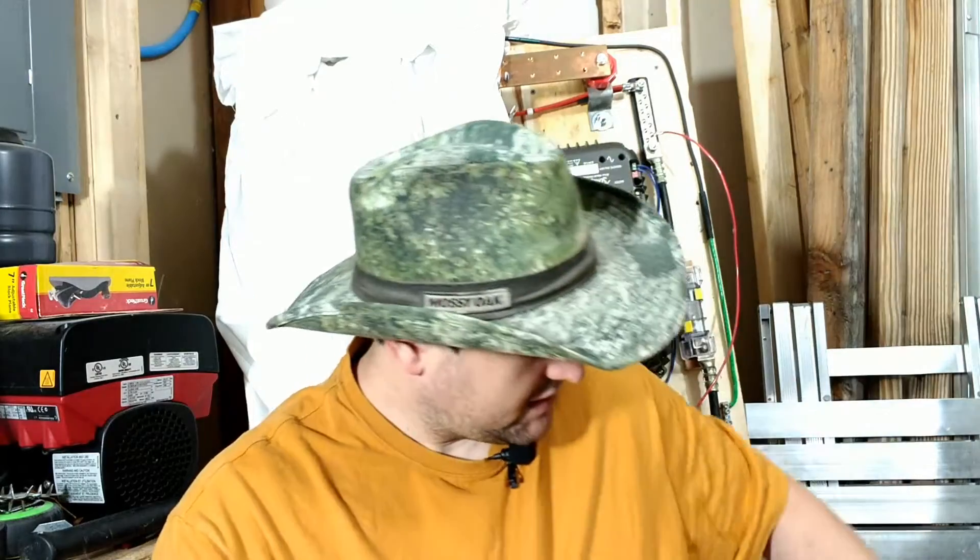Let's look at some various wires. Here is good old 14 gauge THHN wire — standard wire you'd use for wiring up a branch circuit, lighting, and stuff like that. And here we've got two spools of USE-2 wire, meaning it can be used outside on solar panels and is perfectly rated for that. This is 10 gauge stranded, nice and flexible.